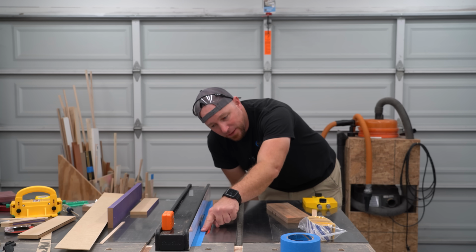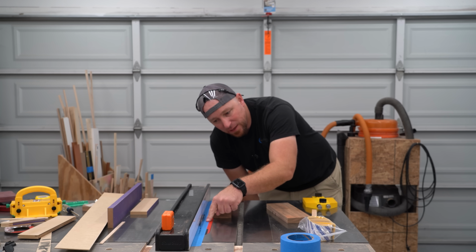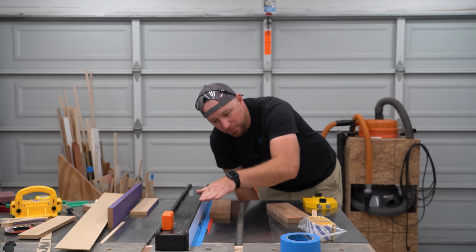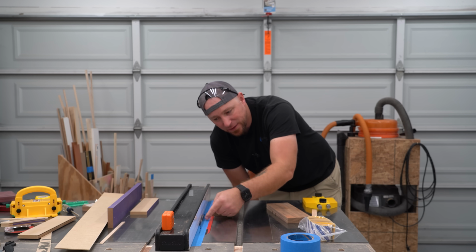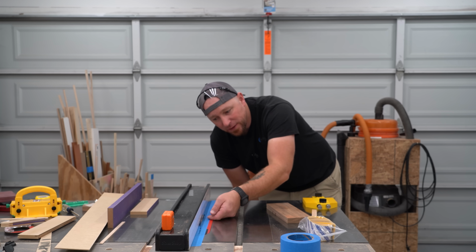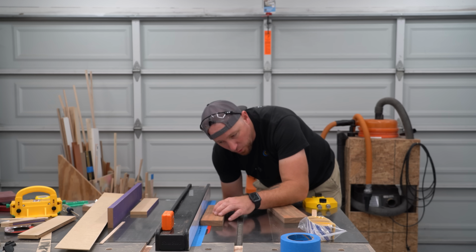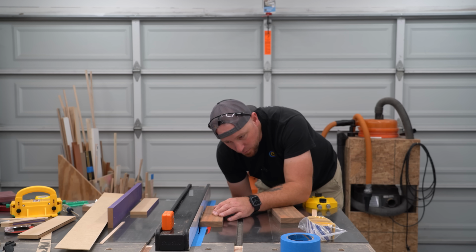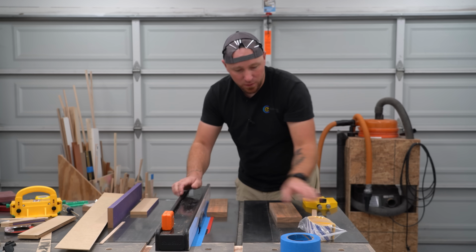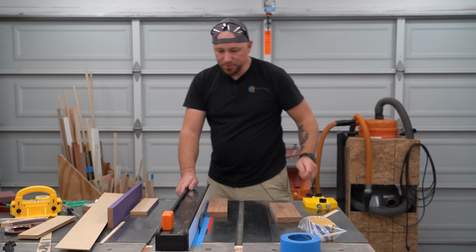We cut that line in here so that the riving knife can now poke through, because if you try and cut through that tape or any other sacrificial or zero clearance fence and you have the riving knife on there, it doesn't let the blade go up enough to cut it. So we take the riving knife off, raise our blade up through there, just slice that in, let that riving knife poke back through. We'll get it up here just to where we wanna go. Make sure we don't have any tape there in the way.